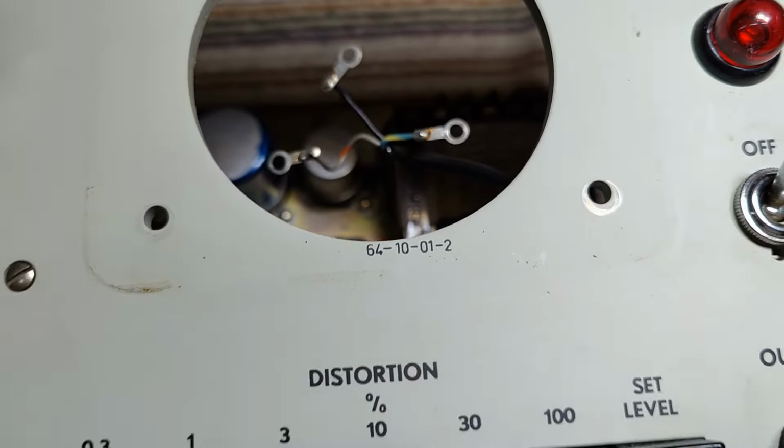Sometimes these meters are just totally stuck. There's no way you can pull out the meter from the frame or the case here, right? The front. So see those tiny little screws? They're so short, you can't really use them for any tricks. So here I found another screw that's a little bit bigger, so this sticks up a little bit. So here's my little secret trick how to solve this. See, if I take down that screw like that, right? See what I can do?